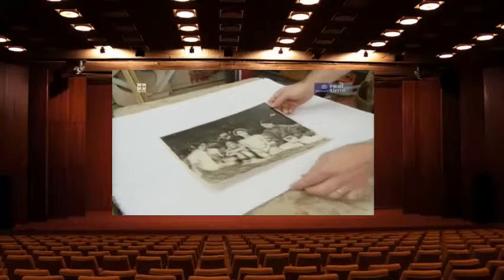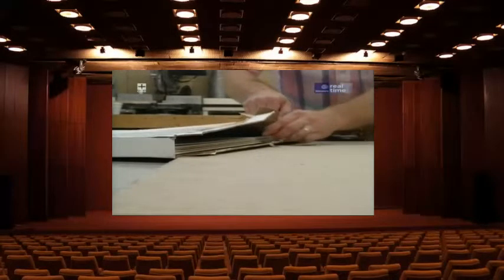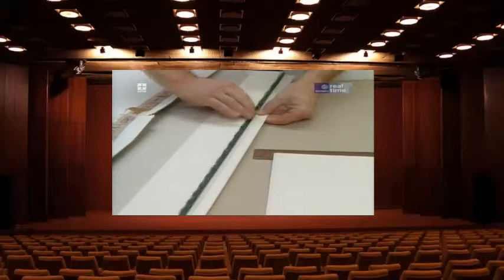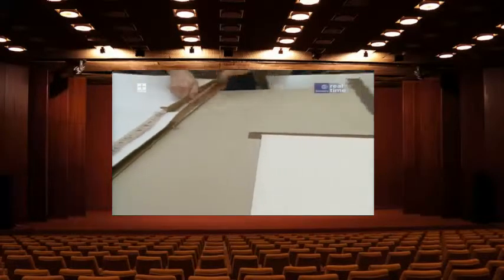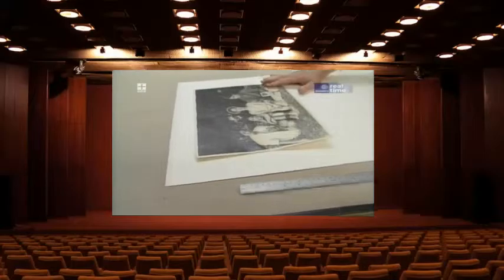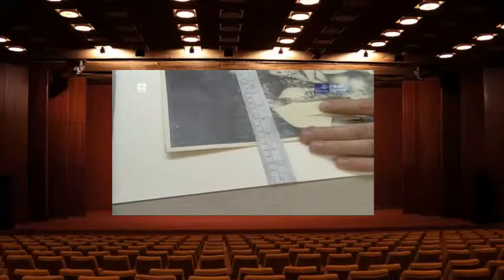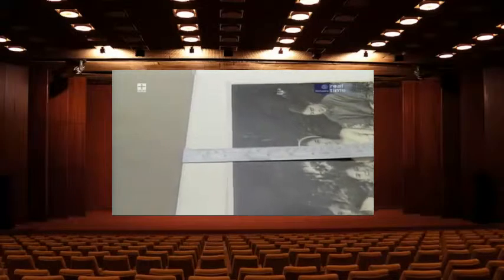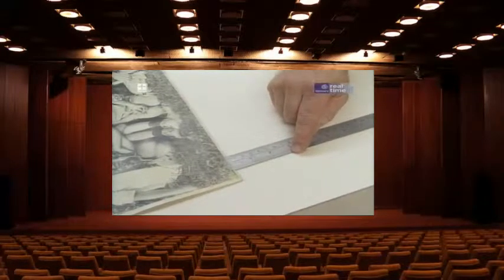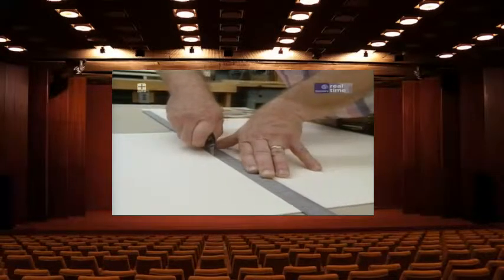There's one more picture to frame with that decorative molding — a photograph of some friends. But before cutting any wood, the matte board gets cut first. Matte board picked up at an office supply store offers an unlimited selection of colors and textures, but basic whites seem to work best. Setting the overall size of the matte: covering the white border on the photograph with at least two inches of matte, then allowing another half inch to fit into the rabbet — the same at top and sides — but picture framers say the bottom should be a little wider, so two and three-quarter inches at the bottom.